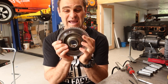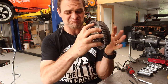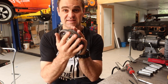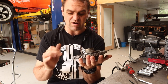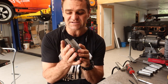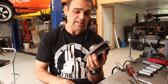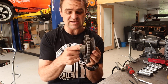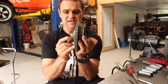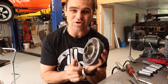That is all mounted up and looking really good. I'm happy that it's nice and centered and the bolts are nice and tight. I haven't Loctited them yet because I still may want to disassemble this. Just to be on the safe side, you should get these things balanced - and I've looked it up, I'm not sure where to get these balanced professionally, but there is a way to balance this myself. To do that, I need to get a shaft that this can sit on that hangs out either side. So I'm going to get on the lathe again, find a piece of stock close to the right size, and machine up a shaft so I can show you how I'm going to balance it.